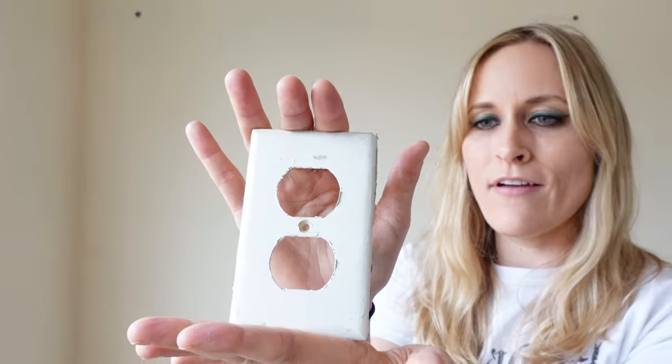If you want to freshen a room, you likely have outlets with the landlord special on them — meaning someone has just painted over them. I'd recommend either getting new ones, which are pretty cheap, or getting paintable light switches. If you're doing a color in a room, paintable switches can be very helpful to make things more seamless.